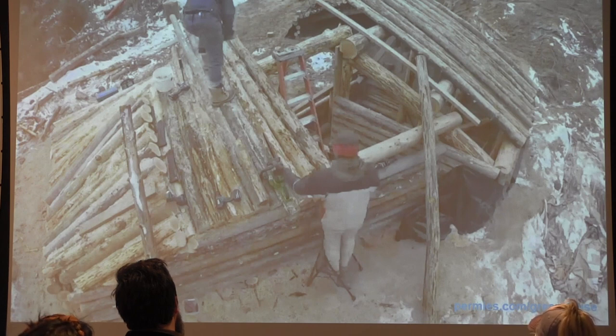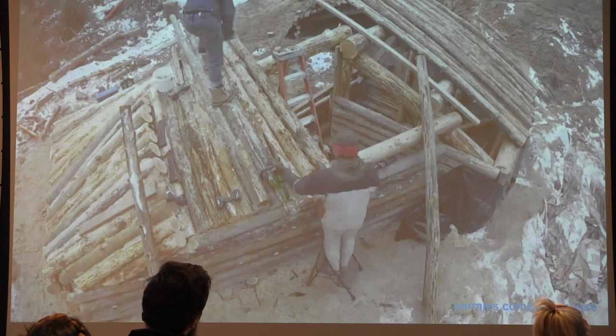It looks a little bit like a log cabin. But instead, what we do is we build the frame with good joinery, nice and strong, and then most of the logs are kind of tacked on, like not even attached well enough to be of much strength. Sometimes we even don't attach them at all, because once they get their membrane on them and then they get a bunch of dirt, the dirt will pin them on and hold them in place. Especially with a little bit of cob that we put on the back, the cob kind of acts like a glue, a log glue, to hold it all together.